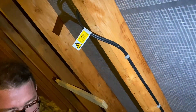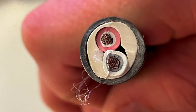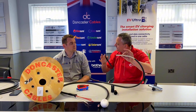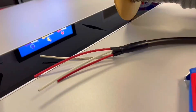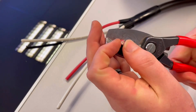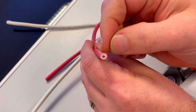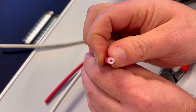On the inside we've got the double insulated cores still, as required. This is still providing the outer sheath with bedding material, but the cores themselves are double insulated because that's a requirement. This is why SWA cable has been advised not to be used - it's only single insulated. This is now Class 2 double insulated insulation on the cores. You see red and white on the inside, and then red on the outer, making it double insulated.